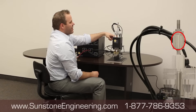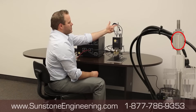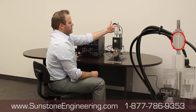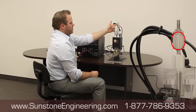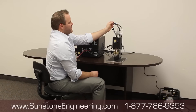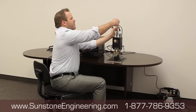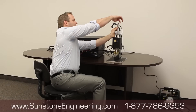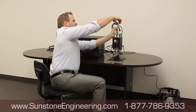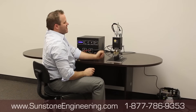I've taken it down too far, so I'll turn it back up a little bit. Now I've reached the point where it's barely turning on. I can lock the travel in place by tightening this smaller nut back down. Now that's locked into place and I have the same amount of travel every time.